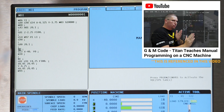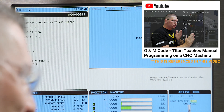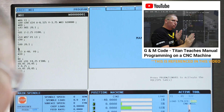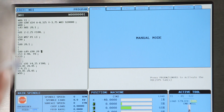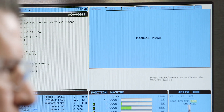And then I would say Z zero, and it would instantly go straight to the top to machine zero. So I'll go ahead and write: G0, G49 to cancel the height offset, and then G90 just for safety reasons, and then Z zero — end the block. Now that gets my tool out of the way. And then I just stay with the G53, X negative 40, and Y zero, and that will send your machine home perfectly.